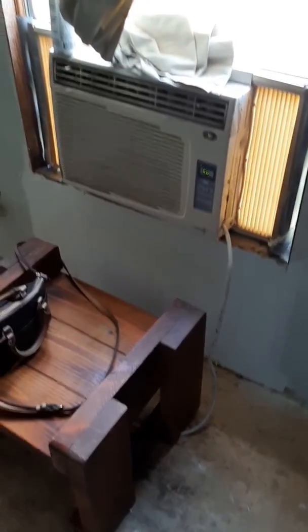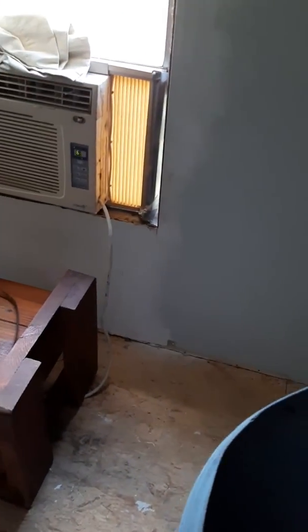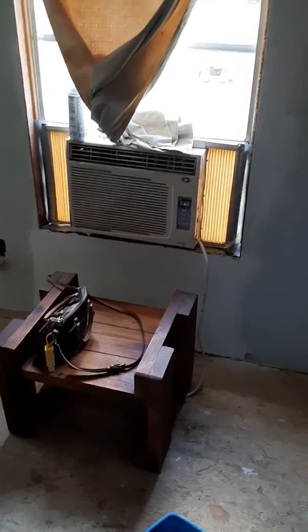This is where dogs peed on the floor. Smelled the urine, cleaned it up. We're gonna sand it up a little bit. That corner just one more time. All up underneath that air conditioner was all tore up, sheetrock, floated over it. We're gonna sand it out, refloat.